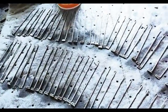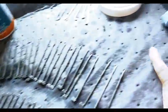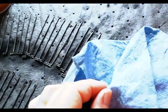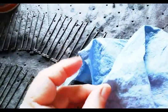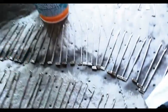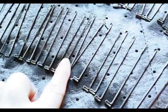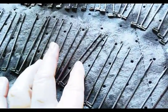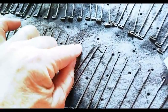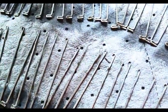Here are my cleaned needles — they've been soaking for about three days in the Marvel Mystery Oil. This batch all seemed clean enough after I rubbed them down with a shop towel; shop towels will catch easily on rough spots, so that was not only a cleaning process but part of checking their condition. This batch needs a little more steel wooling. I've used LPS1 to spray off the needle butts, as they are the part that goes through the carriage, and I don't care for the behavior of Marvel Mystery Oil on needles going through the carriage.